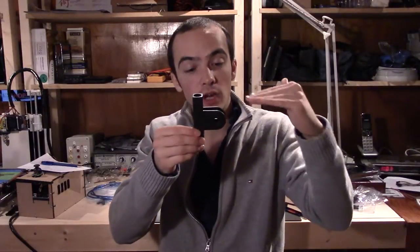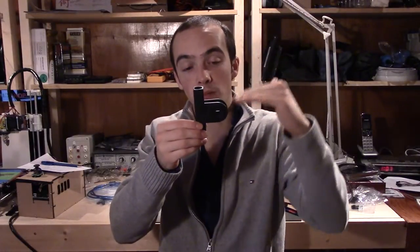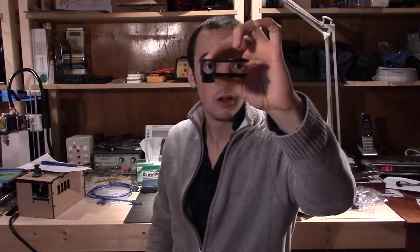And also, you have to think about the grain. Which way are the layers placed? Because the way that the layers are placed, that's your weakest point, okay? But against it is your strongest, right? So anyways, I've got layers all the way up, from the bottom to the top. So that's good for the hole where you insert the rod for the microphone, because it's not going to randomly split and then fall on the ground, because it can't.